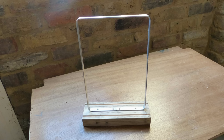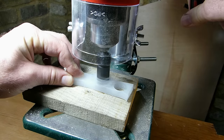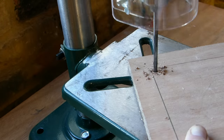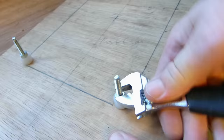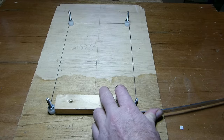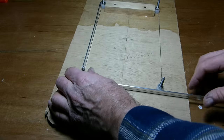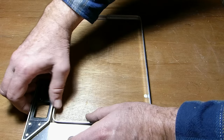To mount the LEDs I've used a rectangular frame made out of aluminium strip which was formed using a simple jig. The corners were radiused to make it easier to mount the LEDs, accomplished with discs at the jig corners. The discs were cut from a plastic kitchen chopping board using a 15mm diameter hole saw. I then drilled four holes into some scrap wooden board and bolted the discs in place. To secure the end of the aluminium strip ready for bending I screwed a piece of wood to the bottom of the jig, punched a hole in the end of the aluminium strip, screwed it to the wooden block and bent it around the jig. I cut off the excess and then checked that the corners were square and the dimensions were equal.